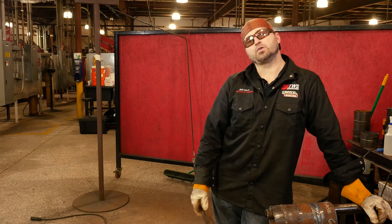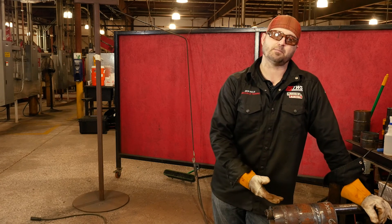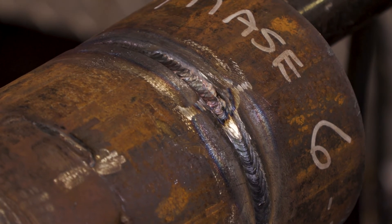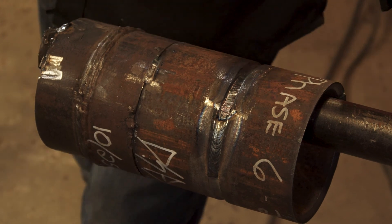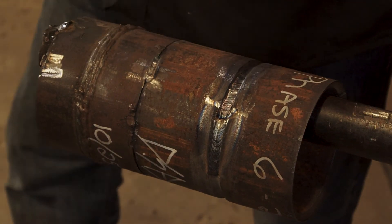This was just a quick tutorial on how to repair a weld. Like I said, we blew a hole in a TIG root and hot pass, so I showed you how to grind it out, clean it up, come back over it, fill it back in, and put a nice good root back in there. Then we'll go ahead and finish it out with the 7018 and put a nice slick cap on it. Thanks for watching this video, and if you have questions or concerns, please reach out to Tulsa Welding School. Thank you.